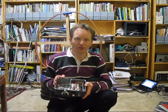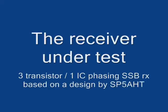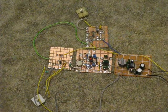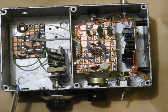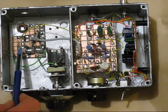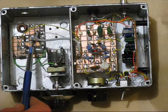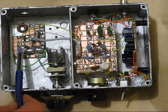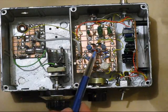In this video, I'll be using some simple test equipment to see how good the image rejection really is. First of all, a quick look at the receiver under test. It's very simple — just three transistors and one IC, yet it's a phasing SSB receiver for 80 metres. The local oscillator is in the left half of the case. It uses two BC548 transistors. It's free running — one transistor is the oscillator and the other is the buffer. That output signal feeds into the balance mixer, which I'll talk about in more detail in a minute.